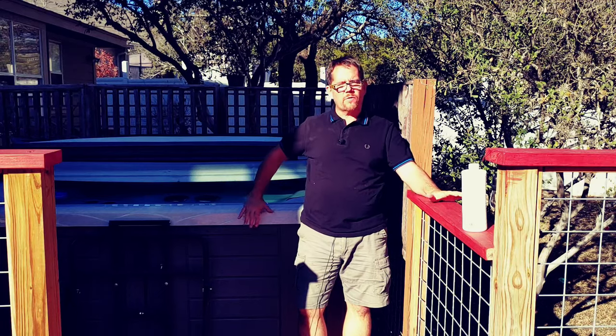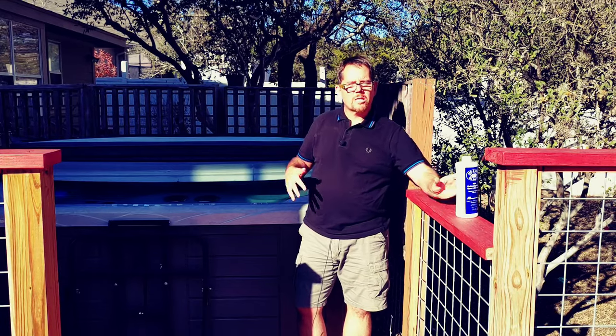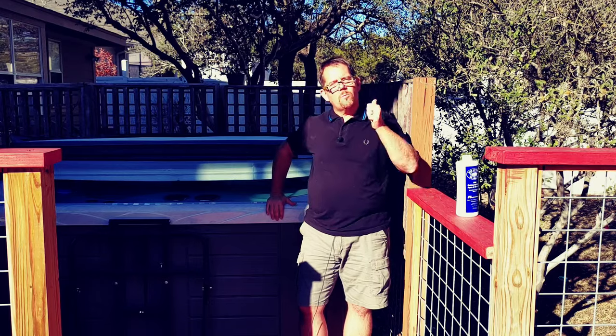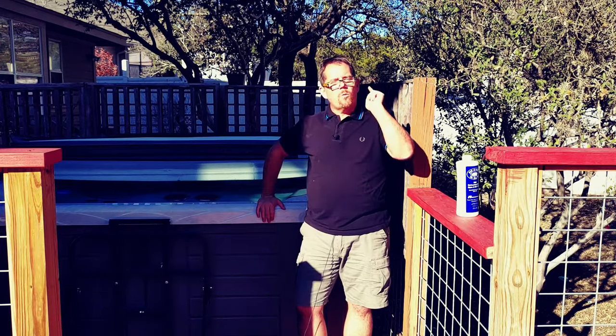Troubleshooting hot tub leaks is not a fun job — it can sometimes be a complete mystery. The Marlig Fix-a-Leak product works really well on leaks no larger than one-eighth of an inch in diameter; I'd say four out of five times I've used it, it worked perfectly. When the leak is larger, you'll ideally want to replace the worn rubber gasket or the cracked PVC pipe. If you can't do that, JB Water Weld epoxy putty works great and can last for years. If you enjoyed this video, please give me a thumbs up, smash that subscribe button, and we'll see you in the next video.